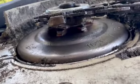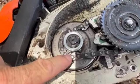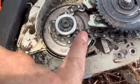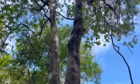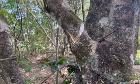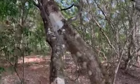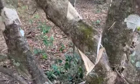When I looked inside I could see something different — the teeth on the motor have worn down on the inside to the point that they're just wedging. What happens is the chain goes up against it and instead of being turned by the teeth it gets wedged into that gap. This presents a couple of problems — not the least of which is the chainsaw won't work. The other problem is I have two things partially cut through this tree, plus this limb going off the other direction that just keeps cracking ominously. It's a pretty good size — if I could pull it down... no, it just made it uglier. Until the weight is fully gone from up top, that isn't going anywhere.